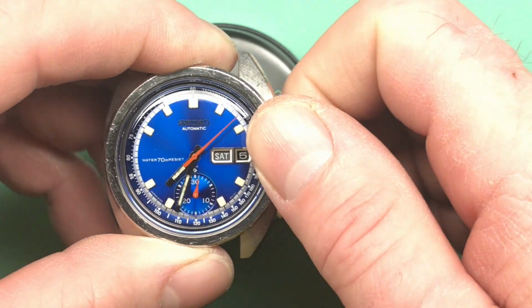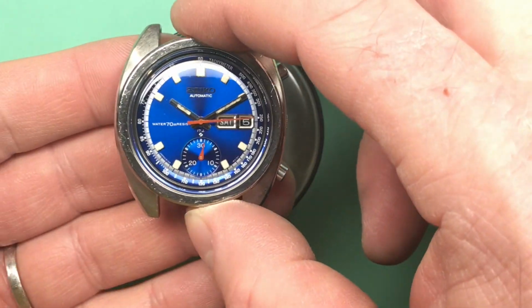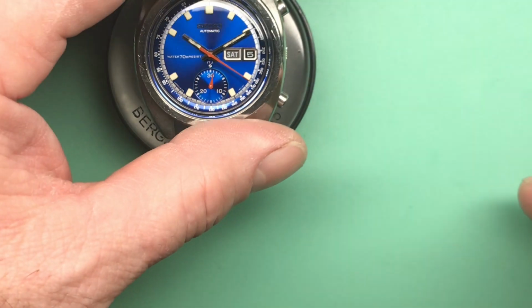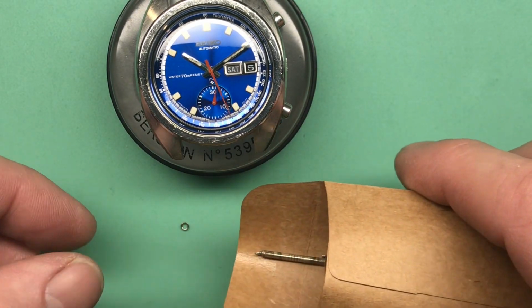Well, Kyle, this is a great watch. A real tribute to your dad to get it restored and get it put back right. Let's just go over the few minor things that we had to do. Your pusher seals and your crown seal, they were just toast. They were so rock hard. As soon as I went to take them, they just shattered away. But you've got new ones.